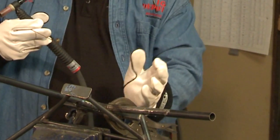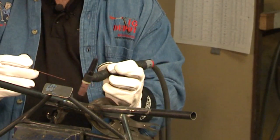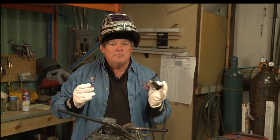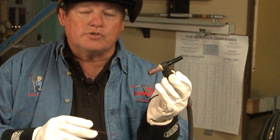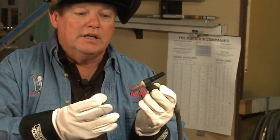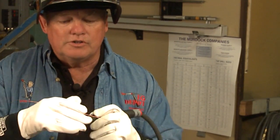Okay, this part has been pre-tacked. I actually have some clamps on here not to hold pressure, but to be a guide, just so I can have the palm of my hand in position — it makes it easier to weld. There are already some tacks on here; you can put more if you like, or less. This is a good fit-up. I'm probably going to put two more tacks on. I'm using a 9-style torch, pointed tungsten, DC. I've got a Lincoln Square Wave 225 machine, and I've got the Argon set at about 15 CFH. So let's do a couple of tacks first.